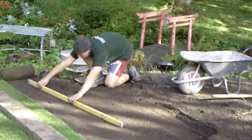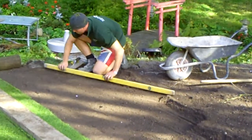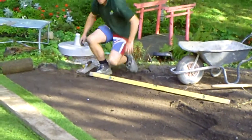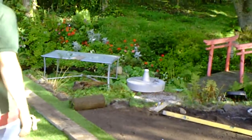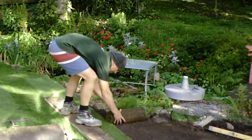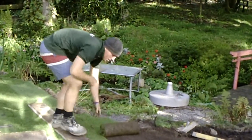Being careful not to work on the prepared area, he's dragging it off again with the straight edge to make sure everything's perfectly level. It's essential also that you get a reasonably dry day so the soil is friable and easy to work with. He's just going to bring it right up to the edge now and roll it out again.